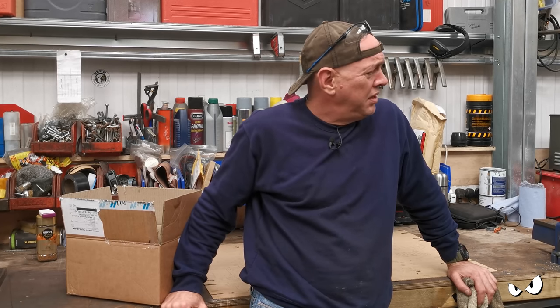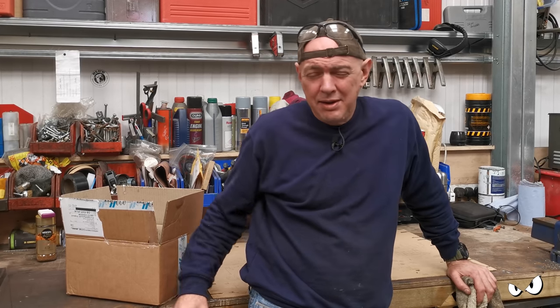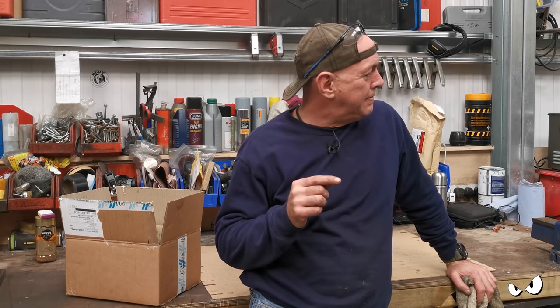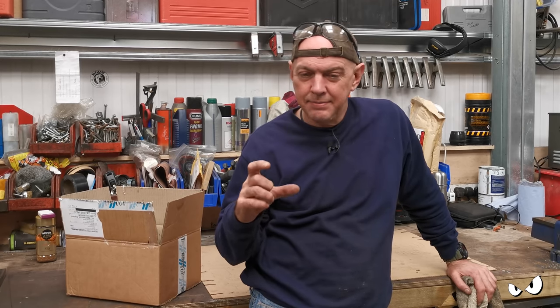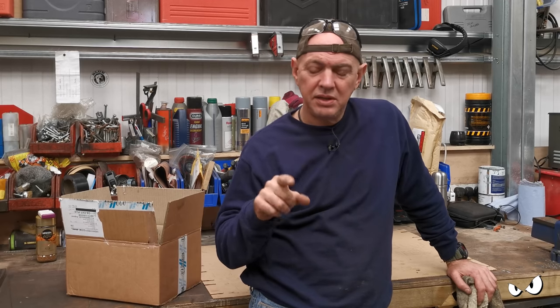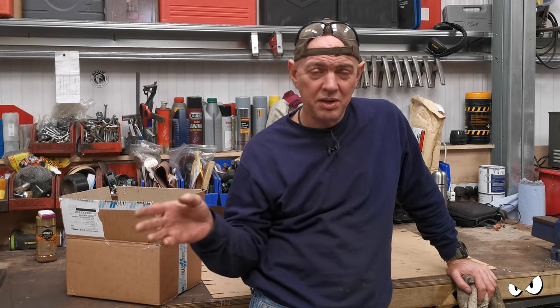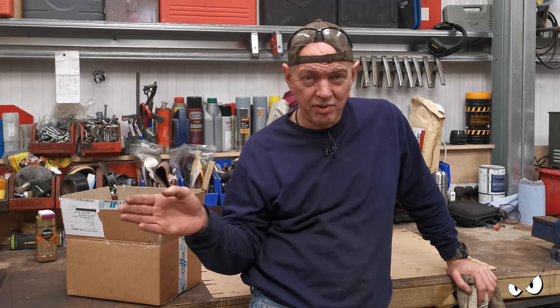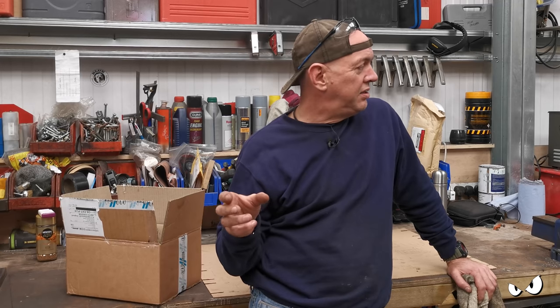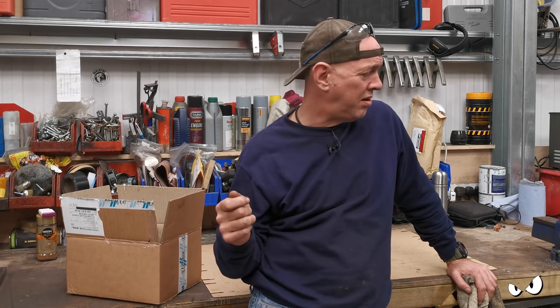Everything's filled up with oil. It's dripping, don't care. It's going to get covered on a regular basis anyway. The only thing we do need to change is, at the minute, Matt has got a single, it's a huge great capacitor, but we're on a single capacitor, a start capacitor. And he rigged it such that when you press the start button, it fires the capacitor. When you release the start button, it stops it. So you're then into continual running. It really does need a dual run capacitor though, so one for start and one for continual running. So we've got one on order. It's a plug and play job, it's not hard,